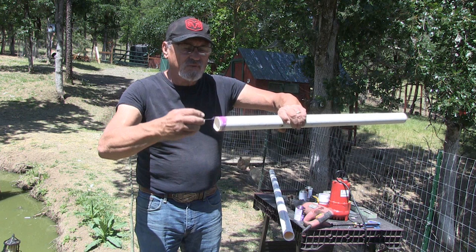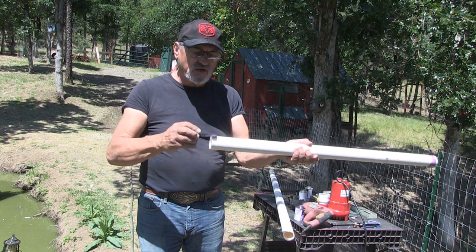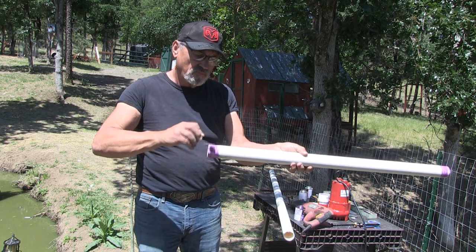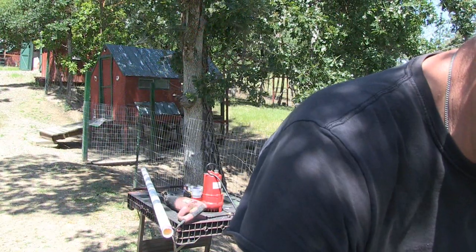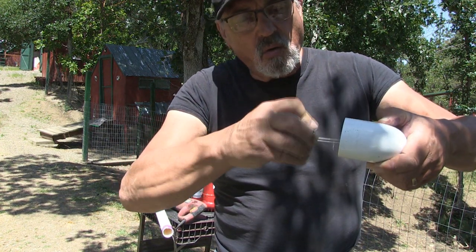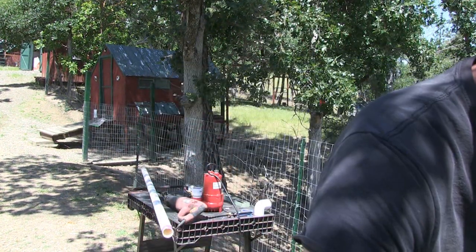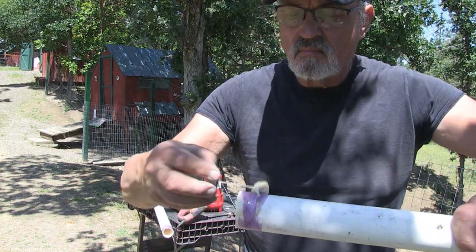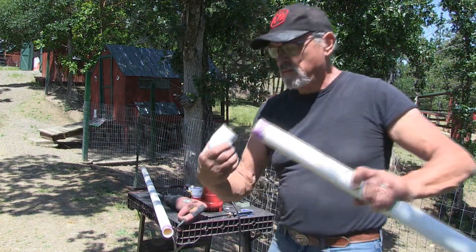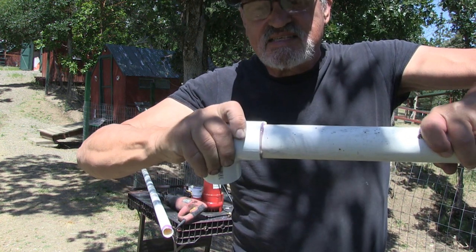And both ends of this pipe, which will extend from the sand filter out over the pond, to attach to an elbow that's going to go down and attach to your pump. Okay, I'm ready to glue the elbow onto the pipe, so I'm only gluing one side of this elbow and one side of this pipe. Place your elbow on and give it a twist so it seats.